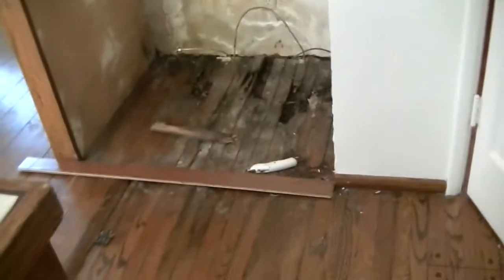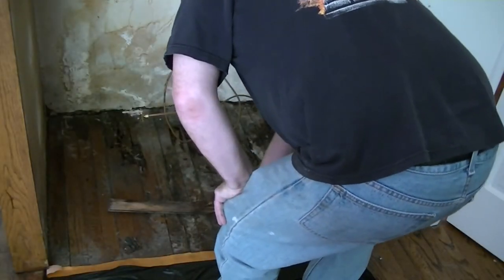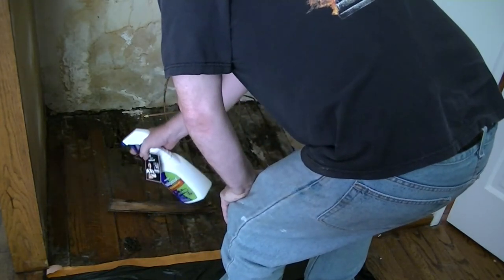It looks like it's down to the substrate - it's real wet and spongy. I was just about to get started cutting the line when I pulled one of the pieces of wood up and realized we're dealing with mold here. I'm going to go to lunch and Home Depot to get stuff for dealing with mold. Here is my solution: mold control spray. The dry mold tends to throw spores up so I've got masks, rubber gloves, and plastic bags to put the wood in. I'm going to spray this down and let it sit.